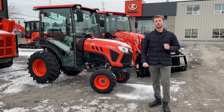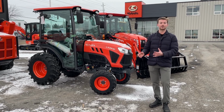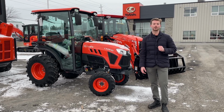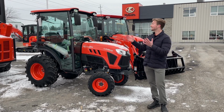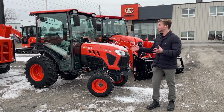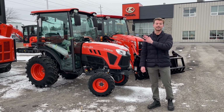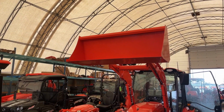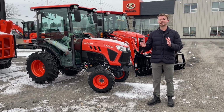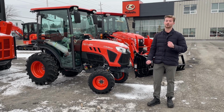So just some final thoughts to wrap up today's video. If you're a homeowner who really wants a cab on their tractor but doesn't want something that's big and unmanageable for the size of their property, they're just looking to do some light duty tasks around their property, do some snow blowing in the winter with a nice heated and air conditioned cab to keep themselves out of the forest with black flies in the summer, getting the LX 2610 is an attractive choice because it's not as expensive as going with the L4060 or even the L60 series in general, but you still get a pretty capable loader that'll lift about 1,000 pounds, so you're not limited to a lot of the tasks that you would be with a B2601 or even a BX series. And again, you get that full factory cab with the nice fit and finish.